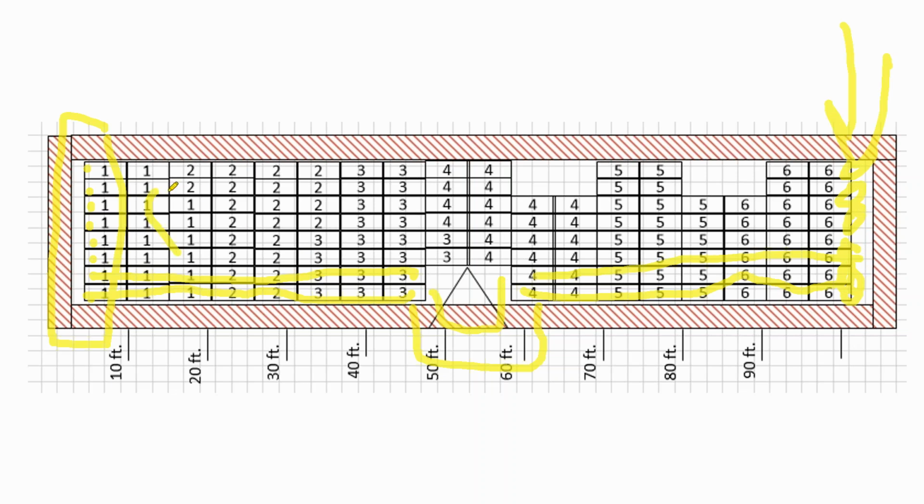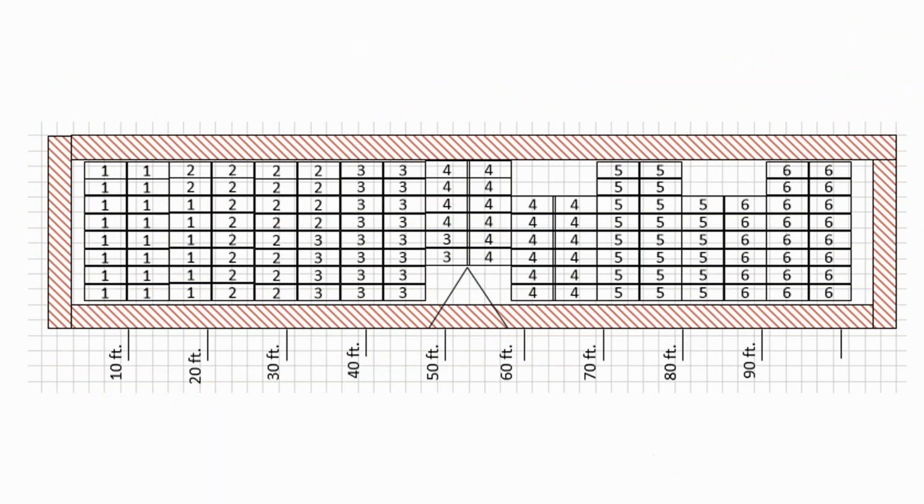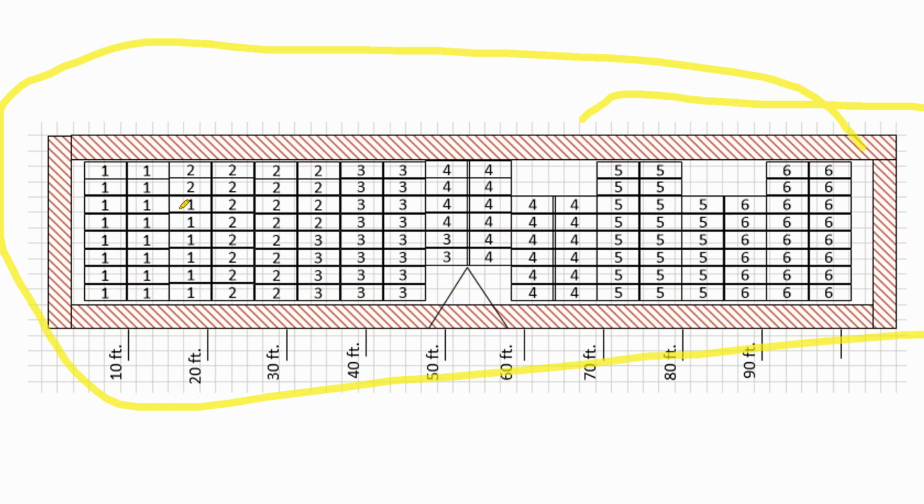And then at that point, rather than running all of these home run cables all willy-nilly coming out of the array, if all of your home run cables all end up on the same section, that makes a nice clean wire run into your transition box. If all these connectors have to move onto the other side of the rooftop, you can do it in one bundle. And the problem is your circuit layouts and where the circuits start and where they stop.